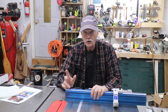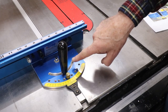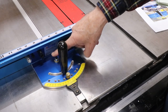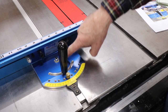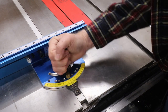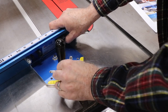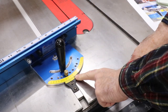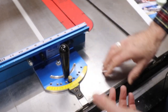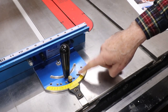Let me show you where I think that quality control is falling down. Miter gauge fence — this is a tightening screw to lock it in place. It pivots on one bolt right here, which is a fairly precise bolt fastening the miter bar to the miter gauge. How you index it is you loosen this, pull this pin out, rotate it, put the pin back in — there's ten degrees. Rotate it back, put it back in, and back to zero, tighten it down. That comes up square every single time in mine.